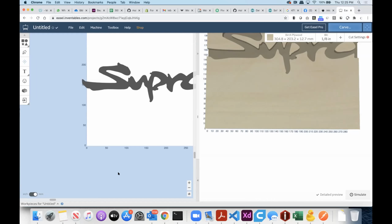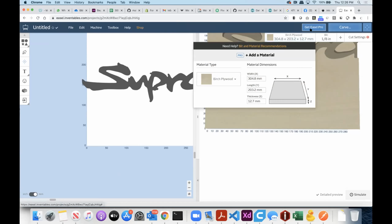How do I go in and make it so that it's a little bit deeper cut? Easel has some safeguards put in place that will prevent you from having a depth of cut that is greater than the thickness of the material. So the easiest way to fudge that in Easel without getting into Easel Pro is to add a tenth of a millimeter or something